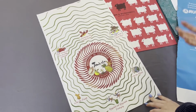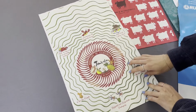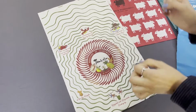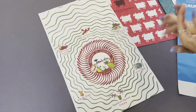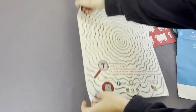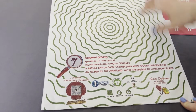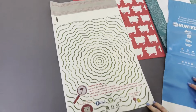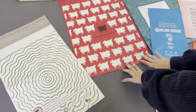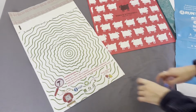It's the same concept as using the 4 different ink cartridges in your printer, but instead it's using 4 different printing plates, each with very, very small amounts of either cyan, yellow, magenta, or key, which is black. And so you can produce this really incredible print with a 4-color process flexographic print. And they really went all out on these. I think they're just super cool. But generally speaking, we can do individual Pantone colors, and we can do a 4-color process also with flexographic.